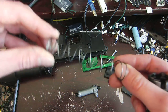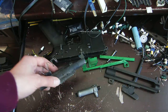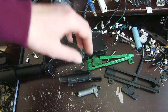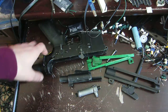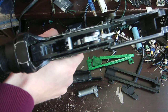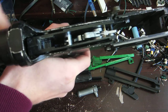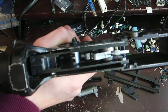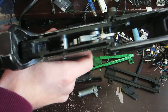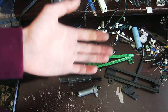Of course, we can't really print a spring well, but it's unlikely that this is going to wear out to the point where the gun just stops functioning. All of these parts up here in the upper half are parts that are taking a lot of impact, so they are going to break at some point. All these parts down here that are all the same zinc sort of pot metal are not going to break, most likely, unless you're horribly abusing the gun or not keeping it maintained and oiled. These lower parts - you're never going to have an issue with them. The parts on the upper are going to break because of the impact, because this is very substantial and is slamming into it very hard.